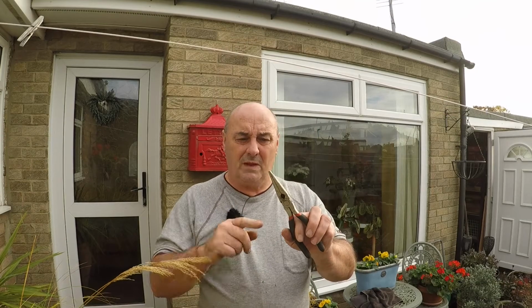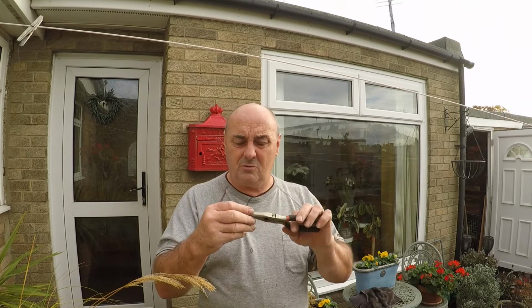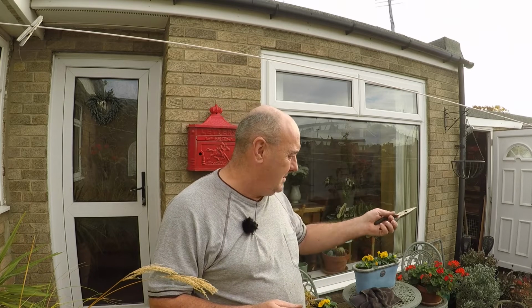Right, back in a minute. We've got a point in those pliers. We're going to cut the tip off, grind down the side so we can get into the valve chest, and we're going to put a nick in the end so we can get a hold of the spool and hopefully pull it out. I'm going to put you on time lapse. I'm going to do a bit of grinding. Alright.